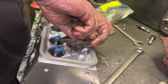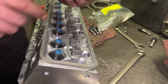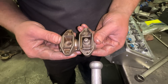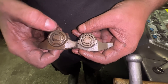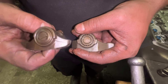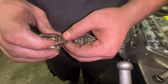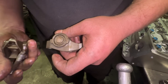Now there's also a lift limit on LS-style rockers because of the way they're built. On an LS rocker it's got this little cap that holds needle bearings, and there's a limit to how far it can move. When you do a rocker trunnion upgrade on one of these it removes that entire little bearing assembly, allowing it to spin freely. What limits your lift then is when the bolt hits the edge of the rocker. These 2.2 rockers almost already have the rocker trunnion upgrade built in — you can rotate it all the way around, there's no lift limit on them.